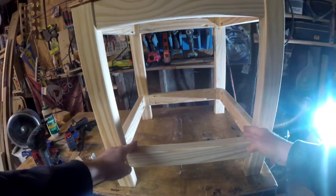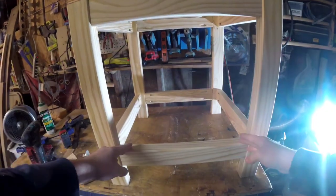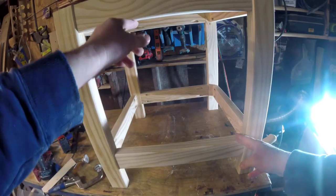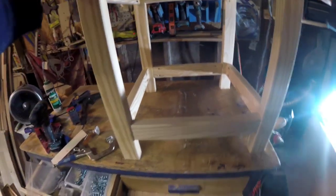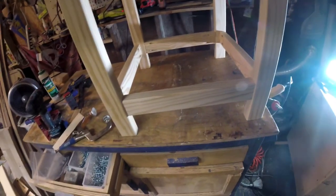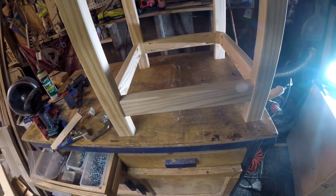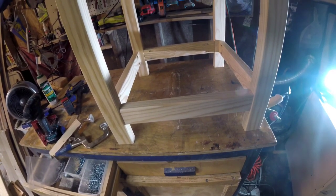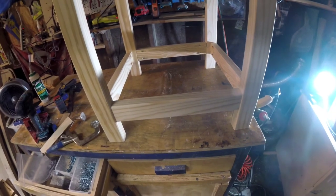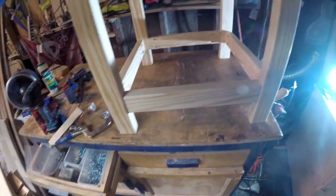They're going to be like a 22 degree angle, and they're going to be about 15 inch long 2x2s, which I'm going to mill up now. I usually mill them up after. Sometimes I do it all at once when I mill this out, but it's a little bit different wood. And also sometimes it could fluctuate. It could be 22 degrees, or it could be 25 degrees, depending on how long I cut it. So I like to just cut one out just to validate.